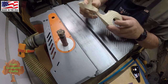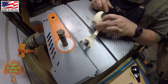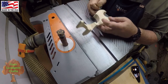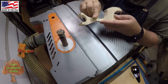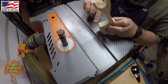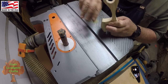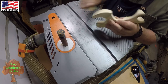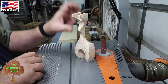That gets all these sides and edges sanded pretty smooth. I usually go over it a few times to get all the saw marks sanded out. Then it'll usually leave some fur or edges from the wood along the edges here, so I just go over it with about 220-grit sandpaper and clean up any of these edges. I've got some fur on there and it's just a matter of cleaning it up with sandpaper a little bit to get it fairly clean — go around all the edges and clean all that up.